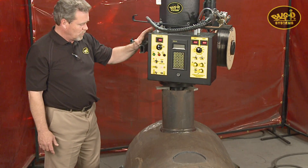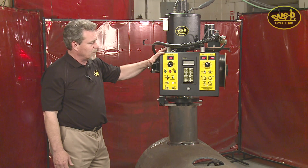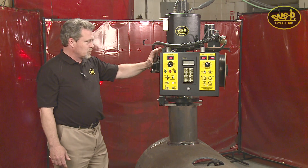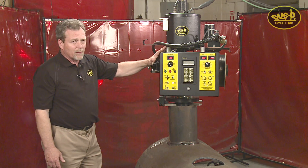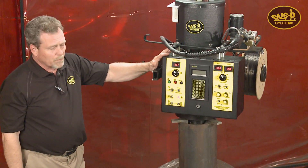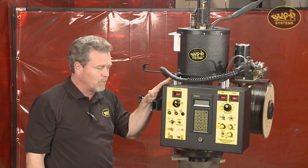The machine is supported to the workpiece with a variety of different size chucks. The CWP-5 itself will do 1 to 12 inch diameter range. We have machines that will go all the way up to 50 inch diameter depending on the application. It's rated at 500 amp continuous duty cycle, and the connection to the power source is fairly basic — simply a two-wire contactor circuit and three wires for 110 AC input, a very simple five-wire connection.